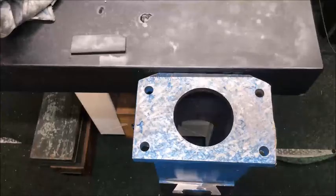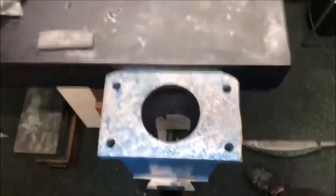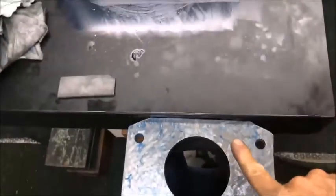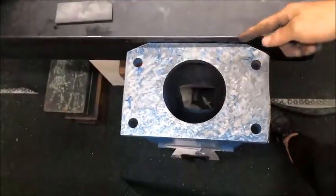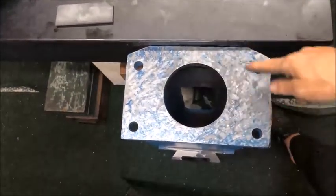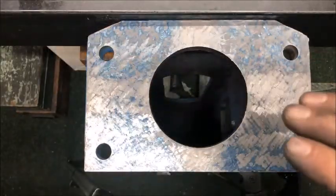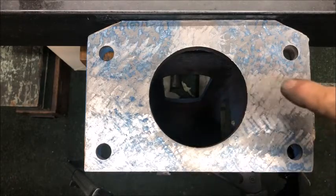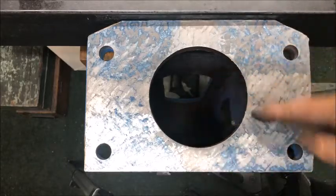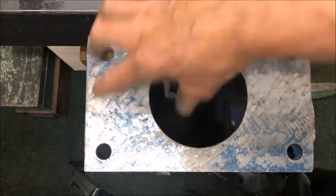From a markup perspective, I don't think it was too bad, really. Remember, this is the column sitting on the pad up there — the big plate — and this is the front. So at least it's marking up all over, a little bit shy here probably. I'm gaining a little bit, but still need some forward tilt, so I'll scrape even further here.